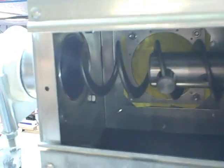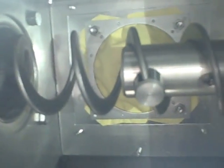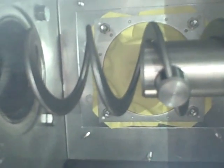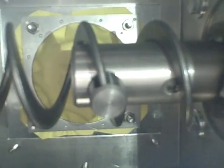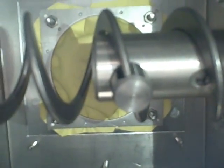We've got the auger set in the tube — you can see it comes out. We tensioned it; it's supposed to be two inches per 50 feet. We're about 25 feet, so we pulled it through until we had about an inch of tension, then tightened this little lock nut down and that buttons it up.